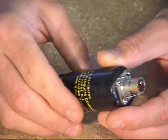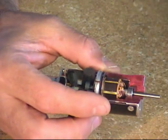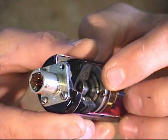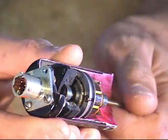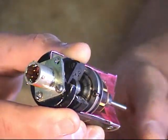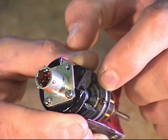There's a three-pin plug on the back; two of the pins are used. Here we have a sectioned generator — this is a pie-slice style armature that the brushes ride on. The brushes are axial, and the armature rolls past. The commutator spins, and the brushes deposit a black film on the armature. That build-up of film is one of the things that contributes to resistance between the brushes and the commutator.